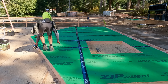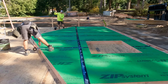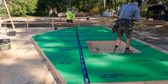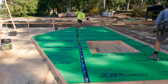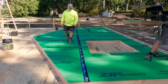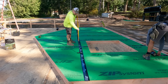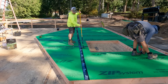I'm going to leave this clip in real time just to show what this process looks like in real time. Also, because we had music playing, I have to talk over it to avoid triggering the YouTube copyright algorithm. So as we mentioned, it's an acrylic adhesive that is pressure sensitive. If you ever use any of these products — there are other companies that make tapes that are acrylic adhesives — put a piece on the wall, smooth it with your hand, do another one and roll it, then come back in a couple of days and just try to peel it off the wall. You'll see it really makes a difference rolling the tape.